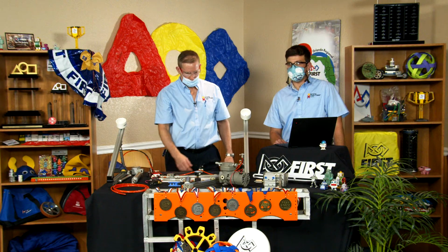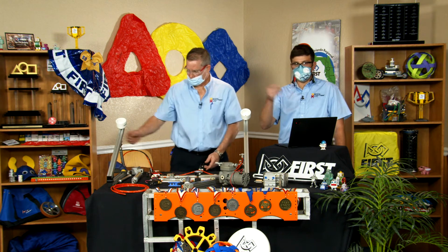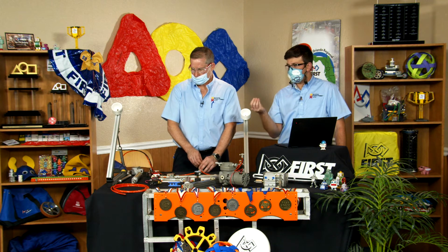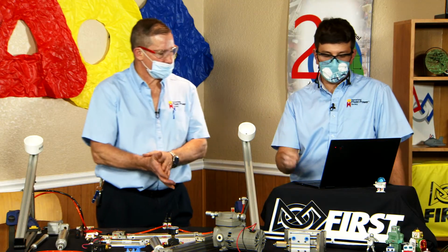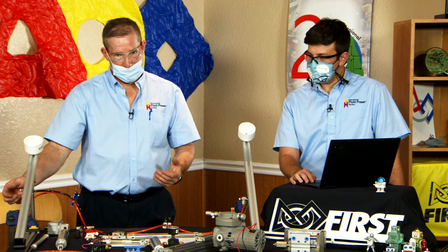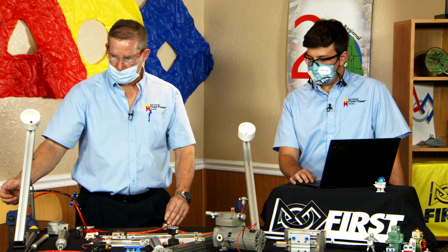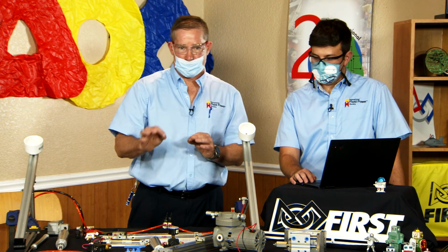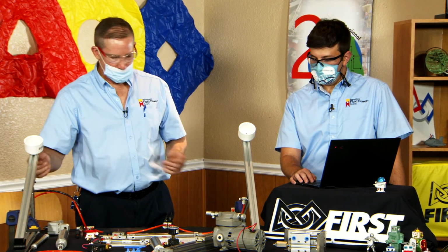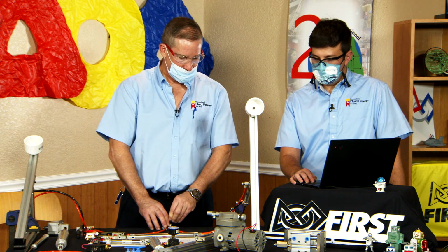You can think about it like the hose in your backyard when you put your thumb over it. When you decrease the size of the opening, you're going to have a lot faster, but a lot less flow through. Same principle here. You're controlling how much fluid, air or water or hydraulic fluid, makes it through that orifice. And you can see how I adjusted by turning this out, how much it actually changes. So by bringing it back in, restricting the flow. If you're wanting to move something slowly, more precisely, a flow control adjusted or tuned in would be a much better option than having it wide open, banging, and potentially causing damage to your machine.